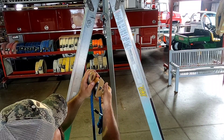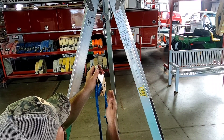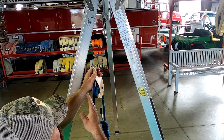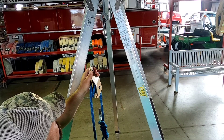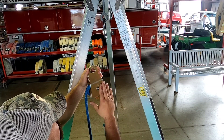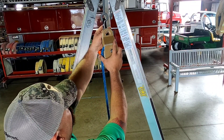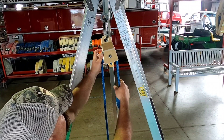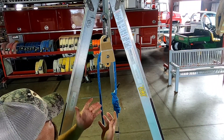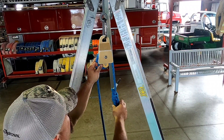Close the side plate and come around the top to the right, so the knot is going away from me over the top — that's considered left to right. Now I'm going to hang this pulley. We're going to start with a 3-to-1, so I'll put this pulley on my carabiner. Now I have my knot going to my load, which makes it an odd system right away. Since I wrapped it twice around my COD, it's going to create a bite where my next pulley will go.